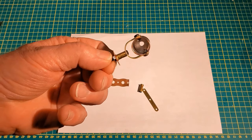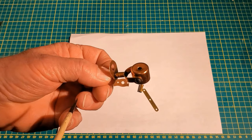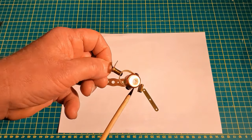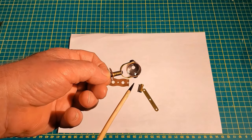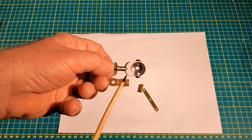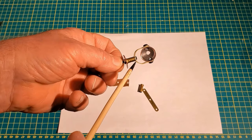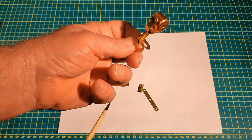This is the same spotlight that I use on the tugboat and the lumber hooker. It's a copper plumbing end cap with a hole drilled in the end and a hole on each side for a 3mm bolt and nut. There's a loop made of brass round with a hole drilled in the bottom. And I have a base, and I have about a 1-inch 3mm bolt and nut to fasten this onto the deck.